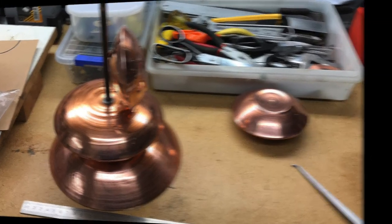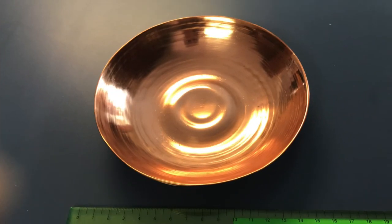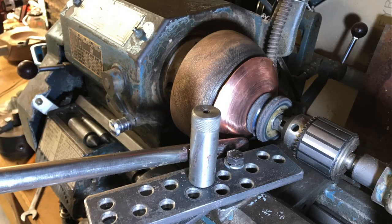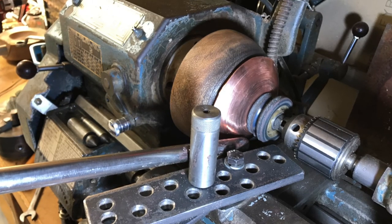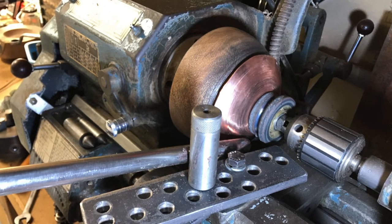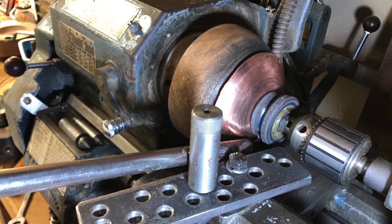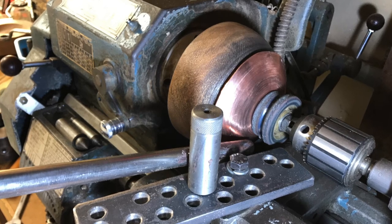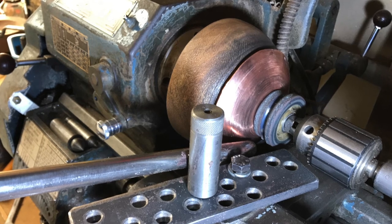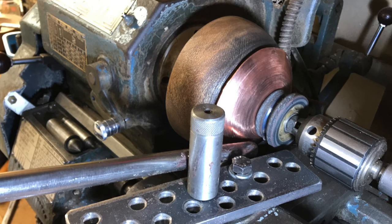While it's spinning at about 600 RPM, you end up with some rather nice-looking objects. I'm building a steam engine, and this spinning process produced some bowls as a side effect. There's a center piece — made from an old skateboard wheel with ball bearings — that holds the copper against the wooden pattern and spins along with the work to reduce friction. However, it does leave a small area in the center that can't be reached to adjust the curvature, so the bowls have an area in the center that hasn't been spun properly.